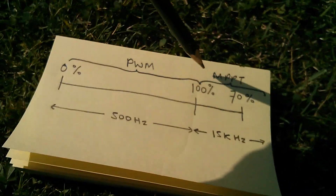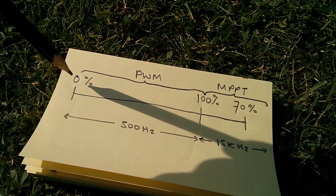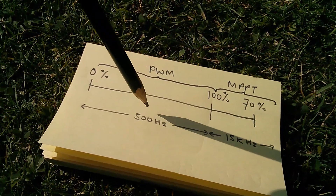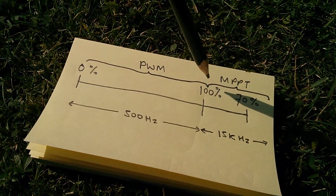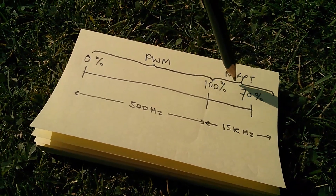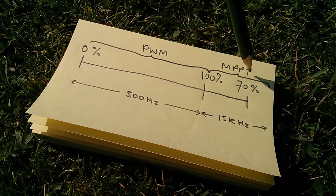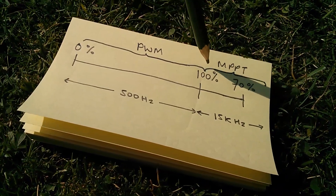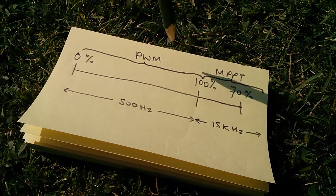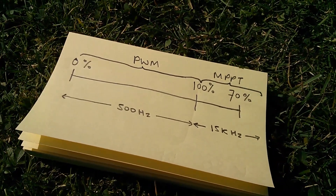This will create an inflection point around the 100% PWM point. Think about this: if the battery is discharged and we're at 0% PWM — from the point of view of maintaining battery voltage — PWM will work in the range 0% all the way up to 100% at 500 hertz. Now if having climbed up to 100% we're still not at float voltage, we can then go further as it were. The percentage starts to come back down again, but at a different frequency — 15 kilohertz. So it extends the range. The percentage of PWM is inverted, made a mirror image, but the frequency is changed, giving an extended range of power into the battery from the solar panel. 0 to 100% is a direct connection, then go further and we get the power maximisation benefit from the buck converter with its inductor.